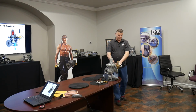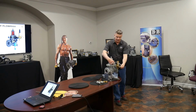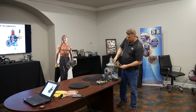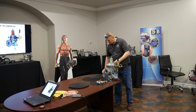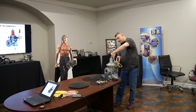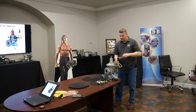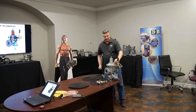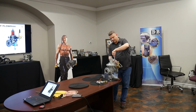And it's basically pushing down a plug seal on an orifice seat, which we're going to look at in a minute. Okay, this does not have to be here for this to work. In fact, if it's the upstream valve, we recommend it come off, and we do it the traditional way. Traditional way being run the sense line downstream from this regulator just like you would from any other Mooney, run it from the pilot sense port, which means that instead of using this indirect path for the pilot to get what the actual downstream pressure is, we'll just give it to it directly, and we'll plug this port.